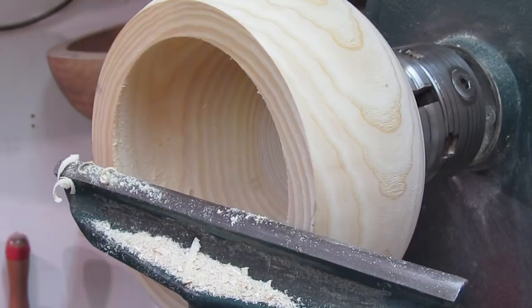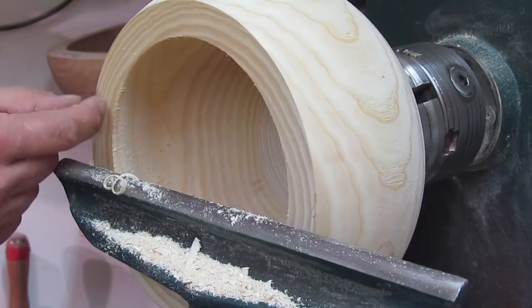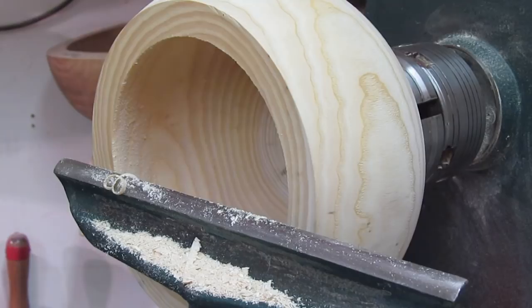It literally took 10 to 12 minutes to hollow a bowl of that size end grain, ready to season. What I'm going to do next is show you how I set up and use the scraping tip as if the piece had been seasoned and finish-turned. Another option is to take the wall down all the way around to between an eighth and a quarter of an inch — three to six millimetres — then finish it with a scraper inside and out, sand it, oil it to slow down the seasoning, and keep it in a cool place for a couple of weeks. I would take the spigot off before I oil it. I'm going to season this one so I can turn it true again, as there will be a slight amount of movement. Then I'll show you how to use the scraper with the extender on the inside to do a fine shear cut for a very good finish.